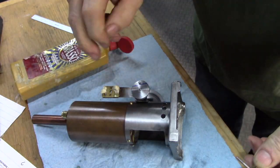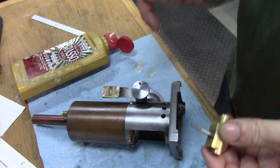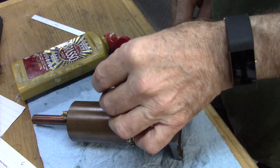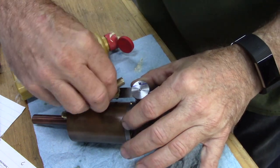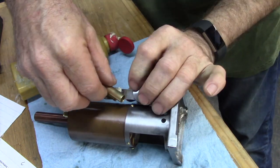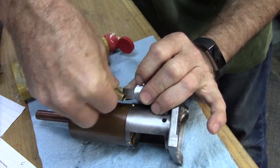The cylinder block that was machined earlier needs to be lapped against the steam port to ensure both faces are co-planar. Brasso is used as a lapping compound here. If the two faces needed more work, then valve grinding paste could have been used, but in this case the Brasso was totally sufficient. The pivot block is used as the axis for the lapping operation and the two faces are lapped together, checking for high spots and fit.